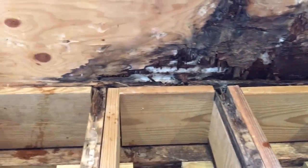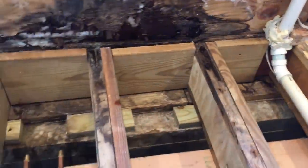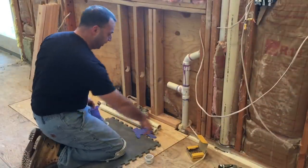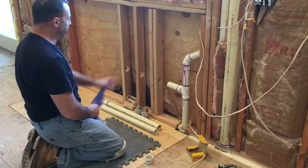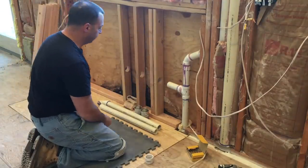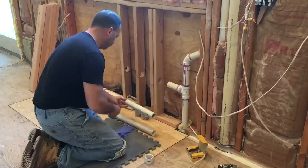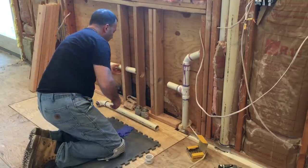To reinforce the ledger board, I cut a couple pieces of two-by-ten and put them along the back. I'm going to go cut some plywood now, get the floor down, and then start rebuilding the studs underneath the window. So I got the new floor in — I cut out the piece of three-quarter inch plywood, notched it out over here, and fastened it down with construction screws. I'm starting to build the studs out to reconstruct the wall. I left this section open so I could connect the drain pipe — here's the old drain pipe and I cut a new piece to size.